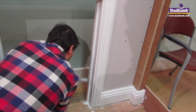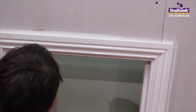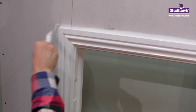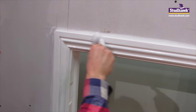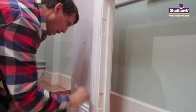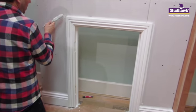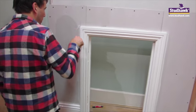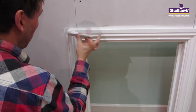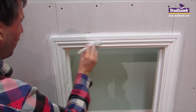Keep a system about your painting and go around the room in an orderly fashion — otherwise you won't know where you've painted and where you haven't. Into my grooves, both ways out of the corner, onto my flat with the flat of the brush, brushing out nice and smooth. It's all about your approach to the work, the number of coats, not trying to put too much paint on at one go, and your laying-off strokes — just the weight of the brush — and then you get a beautifully smooth laid-off paint finish.